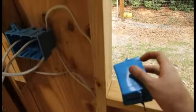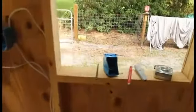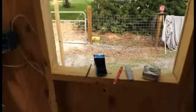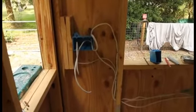These little plastic pieces right there. What was delivered to me from Home Depot was the most economical junction boxes. I went ahead and switched them out for the heavy duty ones. The plastic on the cheap ones is so thin that they flex very easily, and this one looks like it somehow got melted. The heavy duty ones are only about sixty cents more, and they're rock solid. So if you're putting in an order or picking them up, I would recommend spending the extra couple bucks to get those.